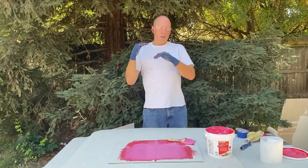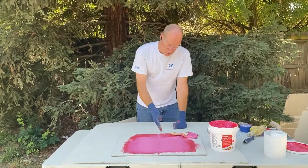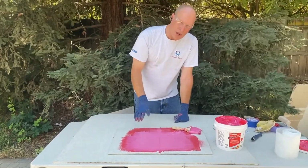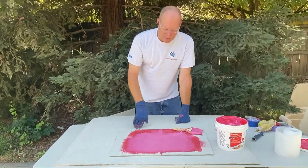So the single layer without the fabric many times is fine. Sometimes manufacturers will allow you to go over this. They'll allow it in different age slabs. Sometimes you fill this with a filling material that they call for, and you can go right over top of it with their membrane, and they will warranty that type of installation.